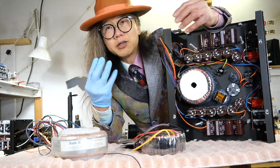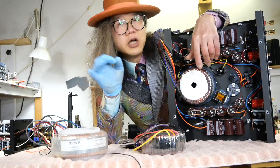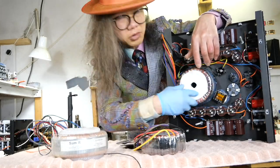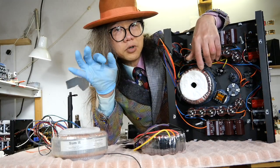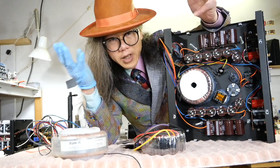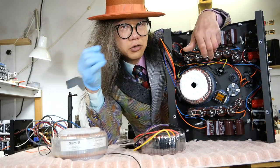The silicone is going to spread the weight and the pull across the chassis instead of just a tiny washer in the center of the transformer. It actually spreads across the whole section of the transformer — pulling from the chassis with the whole surface, not a tiny little washer. So it is actually better from a mechanical point of view; it is stronger. Shipping-wise, we have to deal with shipping every day, so we have to think about how strong it is to handle shipping.